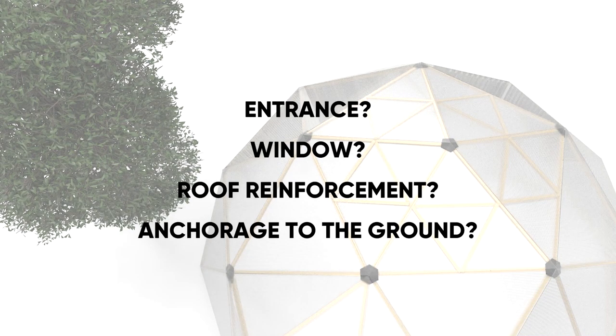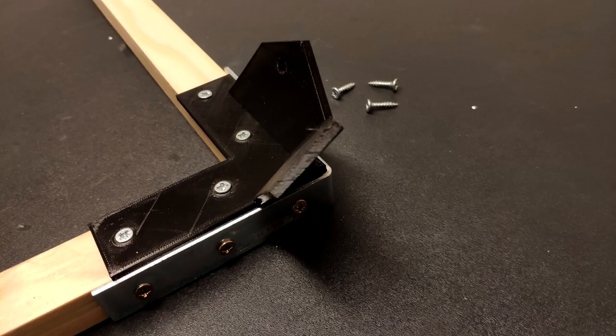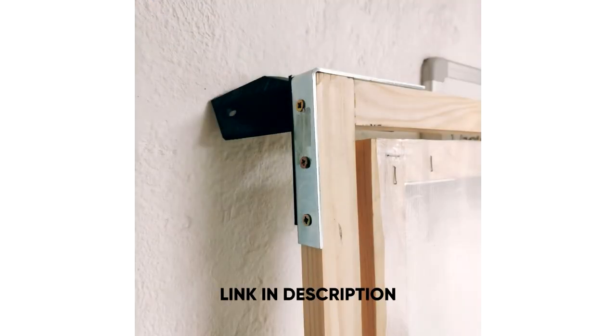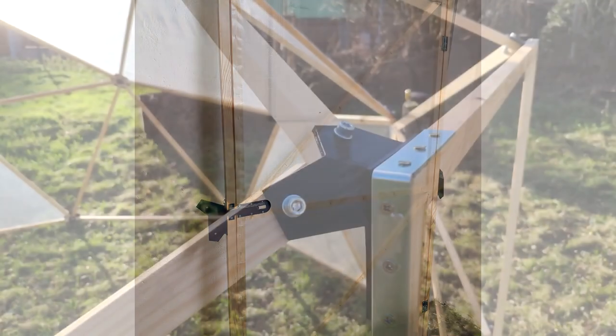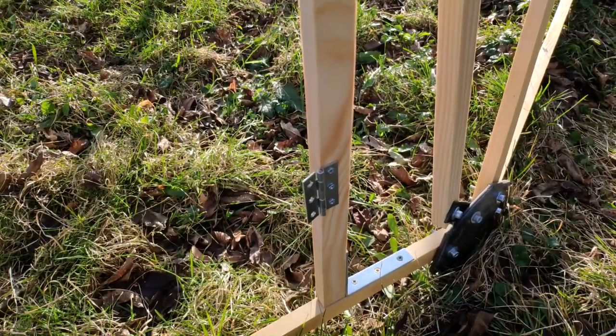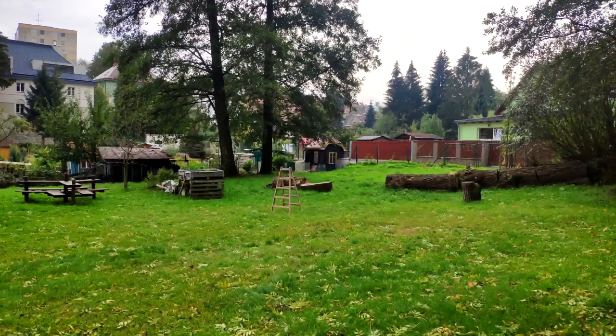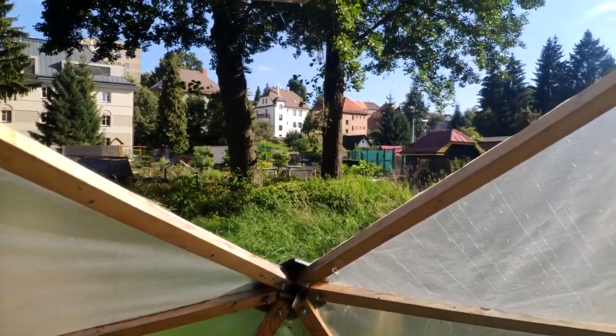But first I had to face some challenges. I made a design proposal in CAD. I'm not a civil engineer, but all blueprints and files I made I share with you for free. Due to uneven ground, the dome was not as precise as in my virtual assembly, so I had to adjust lengths, beams and joints on site. Keep that in mind and prepare flat foundations for your dome before you start assembly.